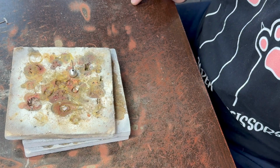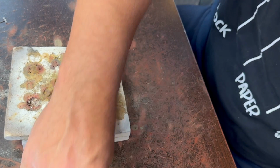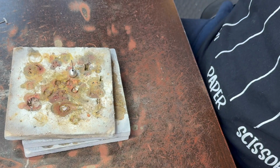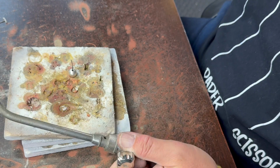I haven't talked about that. I use primarily hard silver sheet solder. I'll occasionally use one of the other types, but mostly that. And I use a liquid flux that I drip on with a dropper bottle. My torch is a Silversmith model. It's their acetylene air torch.